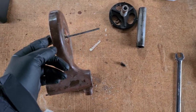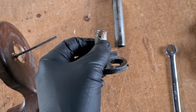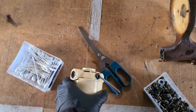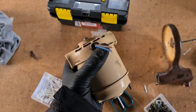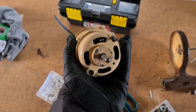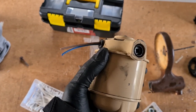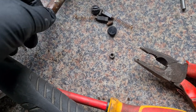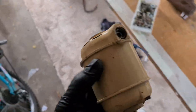Moving on to the motor side of things. This mount came unstuck from the motor basically due to a seized nut, which isn't really a problem. I managed to get this off by drilling out the pin. I've cleaned the motor up and added it all to bits, re-greased the bearings. I think this is a new motor because the wiring isn't black and red — it's more recent brown and blue. Someone has replaced the motor; someone has taken care of it at some point.